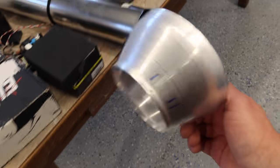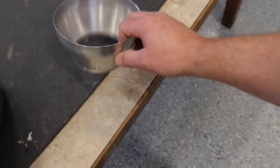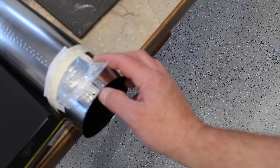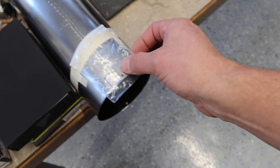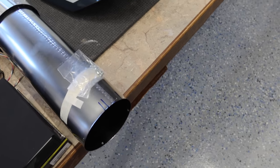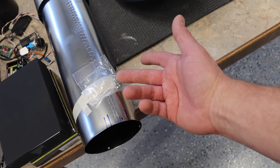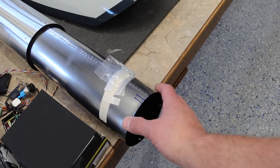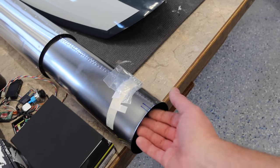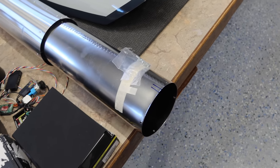So the pipe comes already pre-fit, pre-drilled, all that type of stuff. It's already marked, so beautiful pre-construction by Hispano Aviation. You can see the matching marks there. We've got our mounting hardware. Now, I'm not gonna use this hardware. What I'm gonna use is rivets instead of the bolts and nuts, just because rivets aren't affected by heat. These things could be affected by heat. So that's one of the first steps we need to do to get the engine installed, to get this pipe fit and ready. So I'm gonna get this put in place, put rivets through there and get the bell mouth mounted.